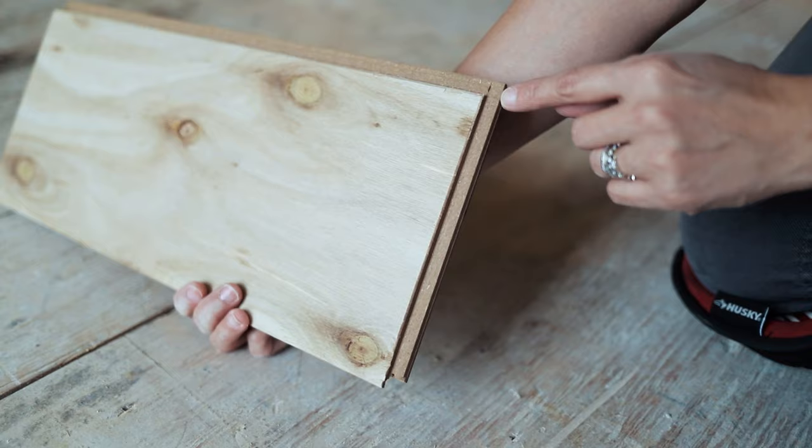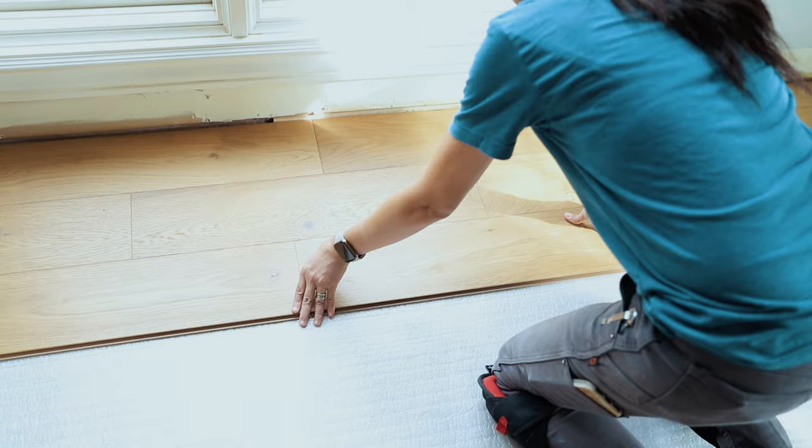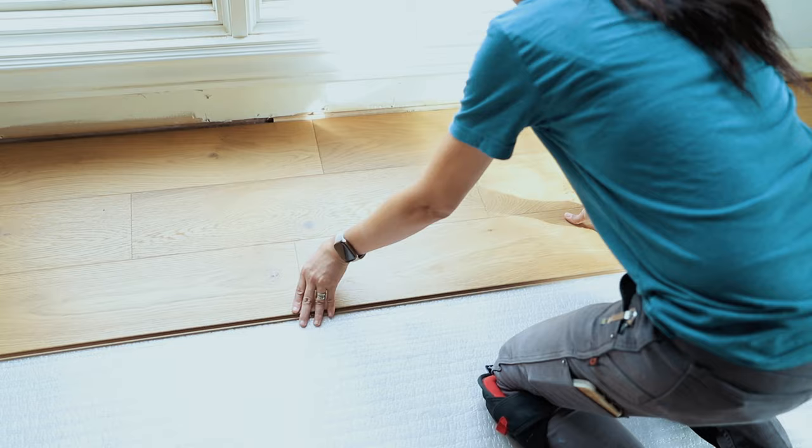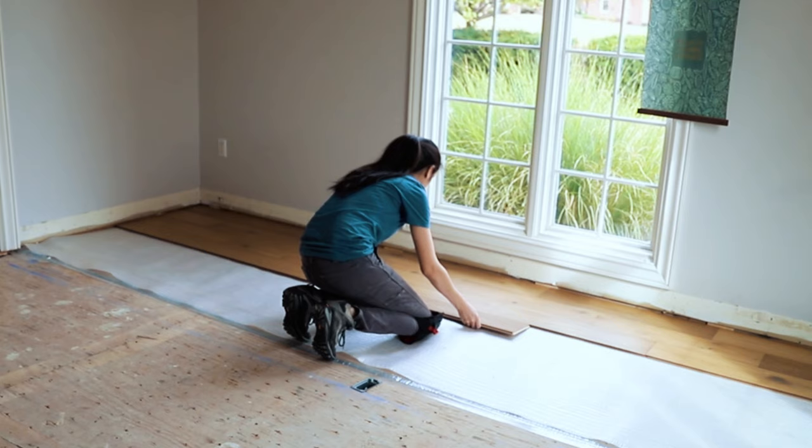Let's take a closer look at the click lock feature. There's a tongue and groove so that each piece fits together like a puzzle — once you lay the tongue in the groove it should click and lock into place easily. You shouldn't have to wrestle with your floorboards. If you are, then something's not right. They really should lay down nice and flat with the joints tight.